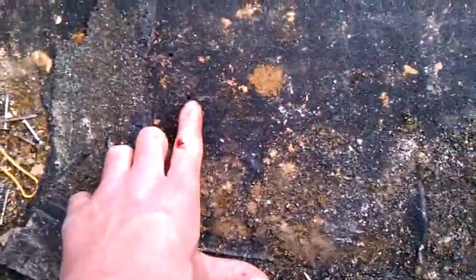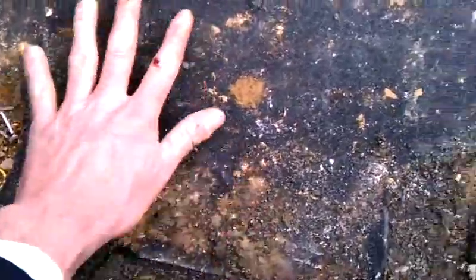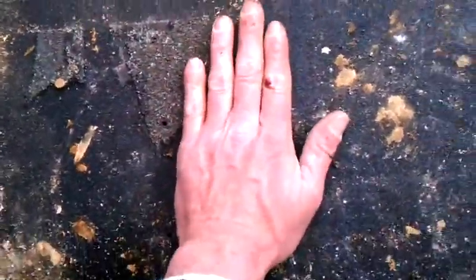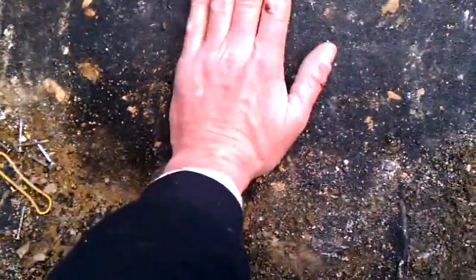If you can look here, there's a nail here. That's where they had nails nailed in the transition. Here's another one. You should never nail in a transition. A transition is where one pitch of a roof slopes into a different pitch. You always want to keep your nails at least a hand's width out of the transition.